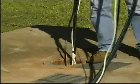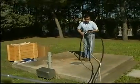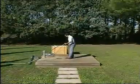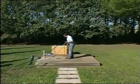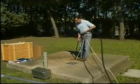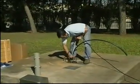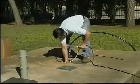We can now lower the pump in the well, making sure that the well is free from bottlenecks and obstacles of all kinds, like old pumps or previously installed pipes. The inner edge of the well should be rounded to avoid the edge cutting the electric cable or the polythene pipe. It should be noted that the operator worked alone, thanks to the pump's weight of only 12 kilograms, and the pipe used made of flexible 25 millimeter polythene.